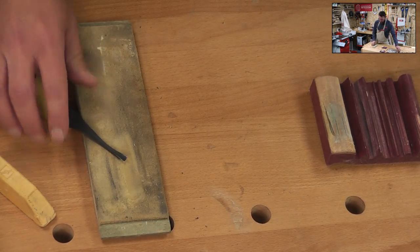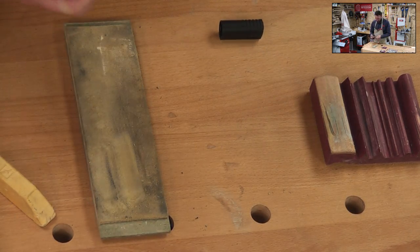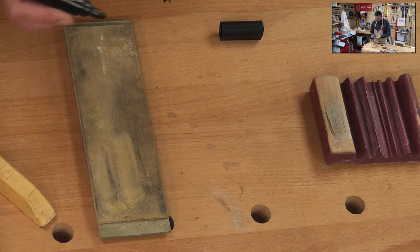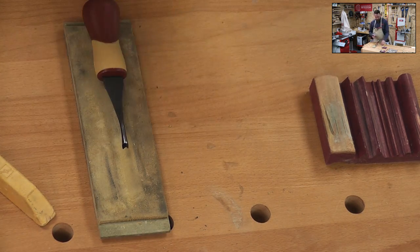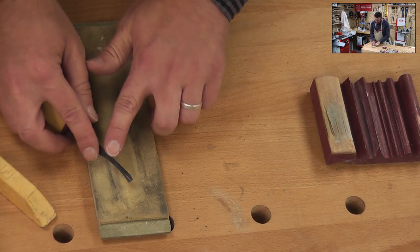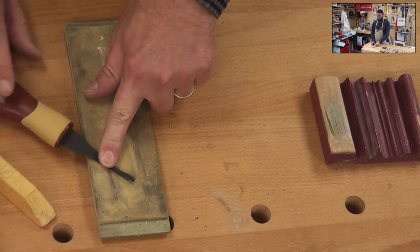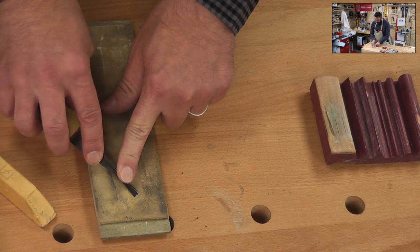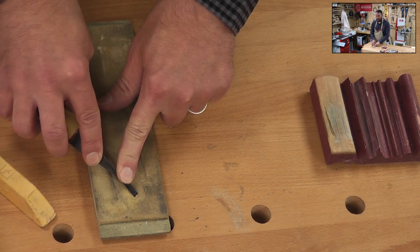And let's put a little bit of marker on this so we know that we're hitting that angle just so. We've got almost three chisels, or two chisels and a gouge, on this V-tool. So, same sort of thing. We're going to present the tool to the strop and just lift the handle until you feel it seat